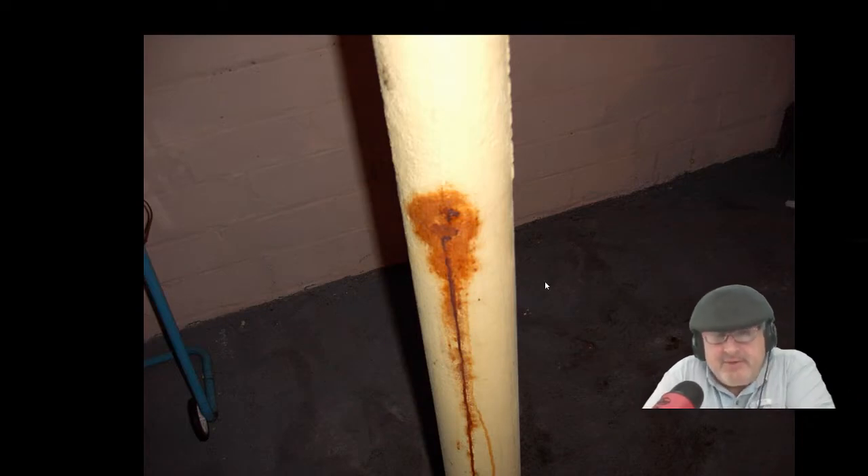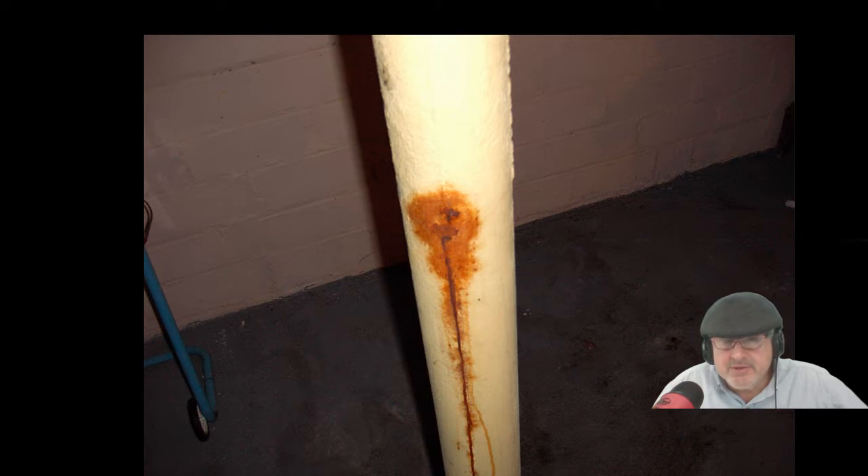More common column issues are rust. They usually don't rust in the center — they'll rust at the bottom. The reason they rust is high indoor humidity, or it's an older foundation. In the old days when they poured concrete floors, they didn't put plastic vapor barriers down, maybe no drainage stone underneath. There's a lot of moisture under homes, and as the house gets older and drain tile gets plugged, you get hydrostatic pressure. Before you know it, the column is sitting in moisture — it's hollow — and it rusts through, and the column starts to compress.